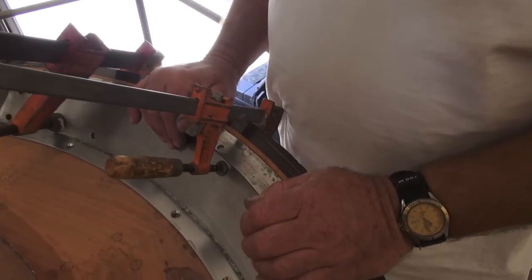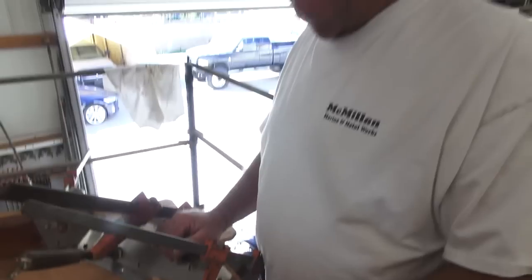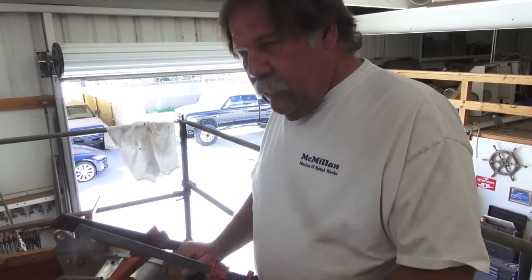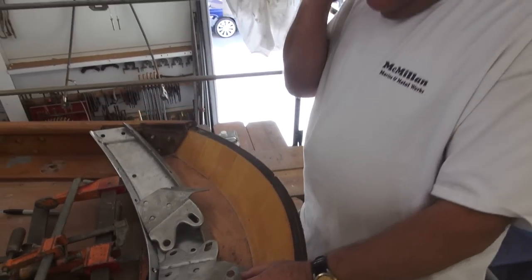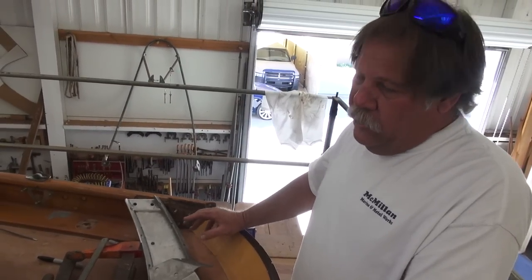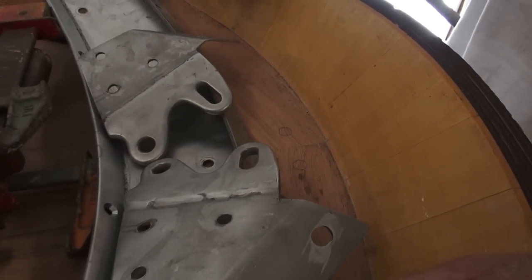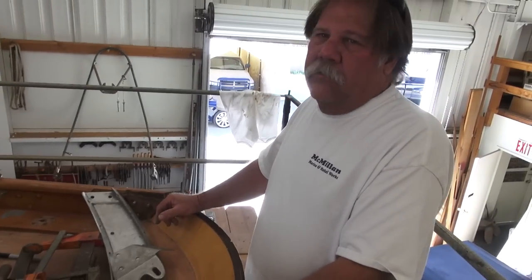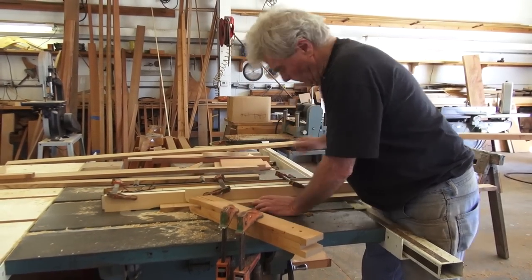Did this piece have to be re-welded here? Yeah, this whole piece at the bottom has been re-welded. So you had to cut that off — what do you use? Band saw. First impression was to replace most of this. But after I garnet-blasted everything and looked at it, I said let's save it. Because a lot of times when you put new stuff on a vintage boat, it does not look like it belongs. It's just better if you can keep the original look going on. It's definitely a labor of love.